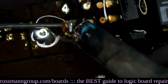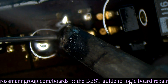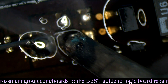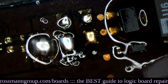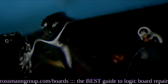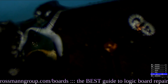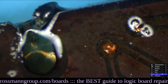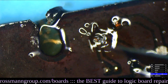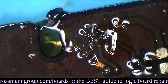Unfortunately, this board has an abused little PP3V42 circuit, but that's fine. We're going to take that little abused PP3V42 circuit and make it happy again. We're just going to scrape away all the junk in that pad and make you a happy little board. You may notice there's what looks to be a broken probe point over here, but that's no problem — you can fix that with a little bit of solder. It appears that it's completely broken so it won't conduct, and that's where the little diode is going to go to ground to pull the voltage on the gate of the inrush limiter down.